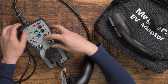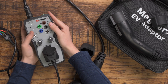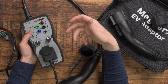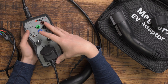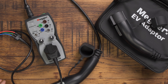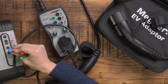Those are the basic tests you have to run through when you test an electric vehicle charging point. This device is essentially like a vehicle — it's the brain that talks to the EV and talks to the EV charging point, telling it what state the vehicle is in and whether it should start charging or not. It's really important that you do these tests along with the relevant RCD tests using your multi-function tester — in this case my MFT 1741 Plus goes perfectly with this.